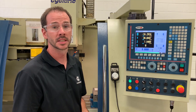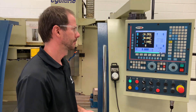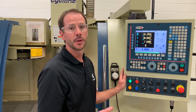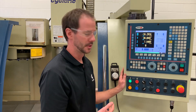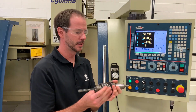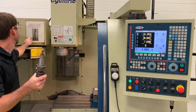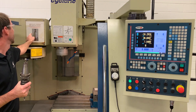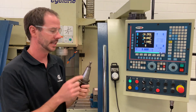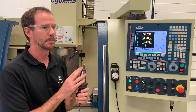You're going to be given a tool list that we want you to follow and you will have to input your tools in the correct position. I'm going to start at T6 — we're already there — and now we want to go into the process of loading our tools into the spindle. I already have a couple of tools built here. I have a 5/16th drill and I'm going to make sure that I'm using the proper pull stud — this is the BT40 pull stud. I can look over here and see that this machine requires the BT40 tool holder, so take a quick glimpse before loading any tools to confirm you are using the proper pull stud.